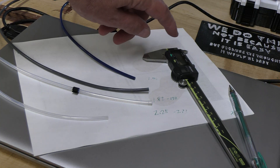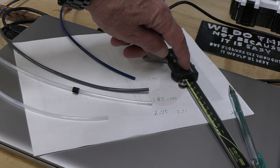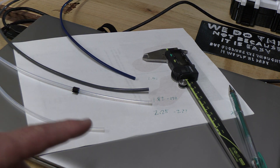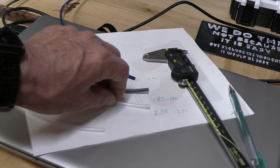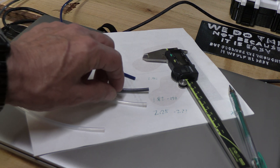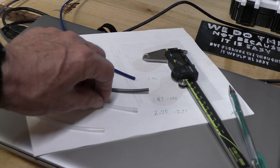When I noticed that the filament wasn't being driven, I disconnected it, unloaded the filament, and tried to pull it through that Bowden tubing — very difficult. So I decided to take a look at these different tubings and look at their inside diameters. I have a very high-quality digital caliper — Mitutoyo, a real one — and I measured the inside diameter of all of these Bowden tubings, the tubing that goes from the filament reel to the extruder.